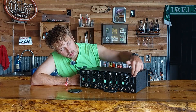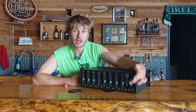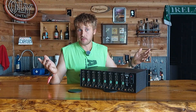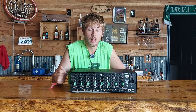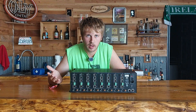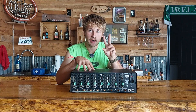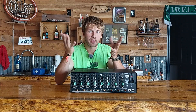On the other side you have power, RS232, and a LAN port for controlling the matrix itself — full control over the matrix. A lot of matrices work off RS232, or if they do have LAN it's locked down to proprietary software. These actually have a built-in API exposed over Telnet.